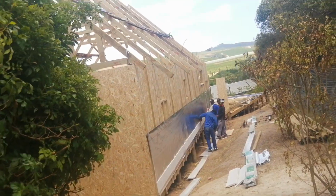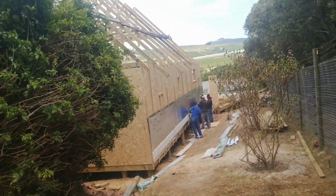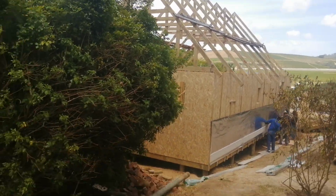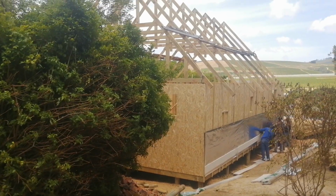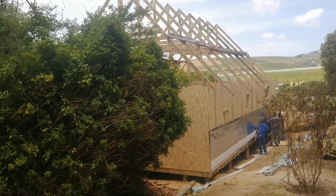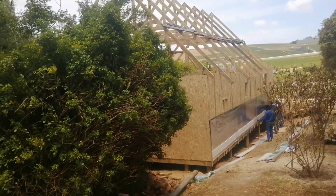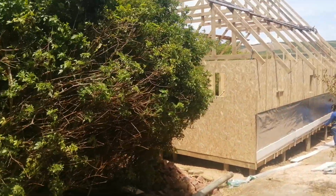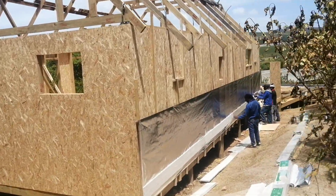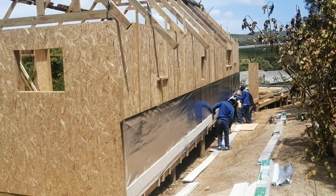So from where I'm standing here, I think I need to call my main builder to stand here with me before we start knocking the second one. Yeah, because my naked eye is seeing that end plank as if it's not straight. It looks like it's going up, but we're going to use the level to ascertain if we're on 100% before we go any further, because I see something that I don't like. It seems as if it's going up.